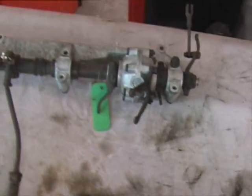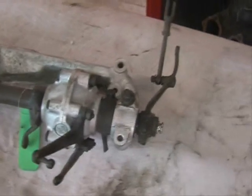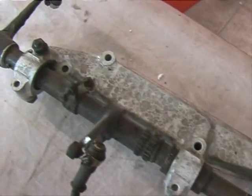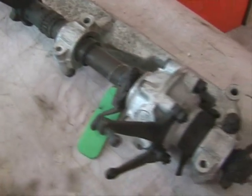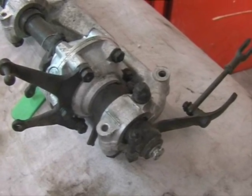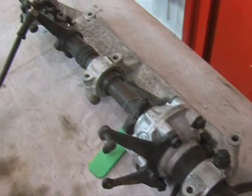And then the engine control shaft — this is how it looks after it's just been soda blasted. Soda blasting is a non-abrasive process, so it really just cleans off all the markings and takes paint off, that type of thing. It shows you the quite remarkable condition of some of the bits of this engine — the aluminium is really clean, the steel is rusty as you would expect but not badly pitted, and that'll clean up really nicely.